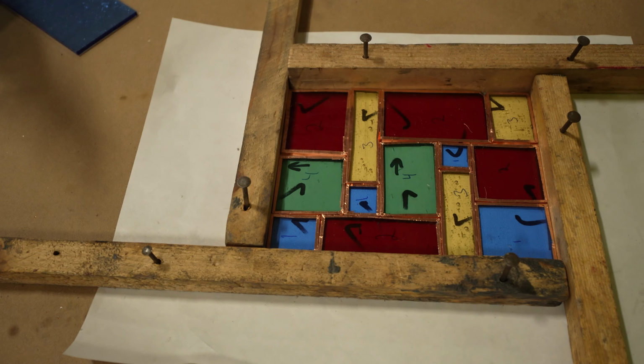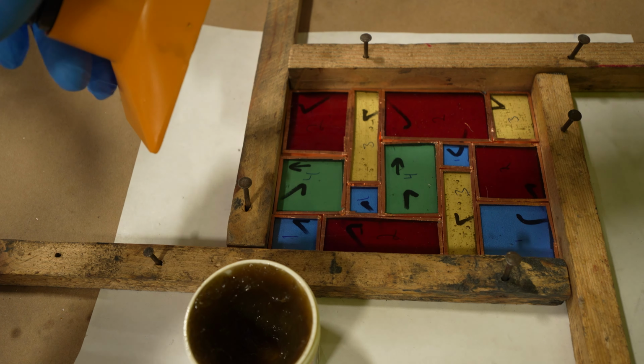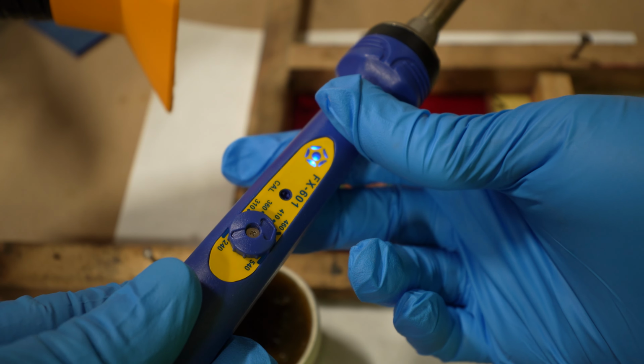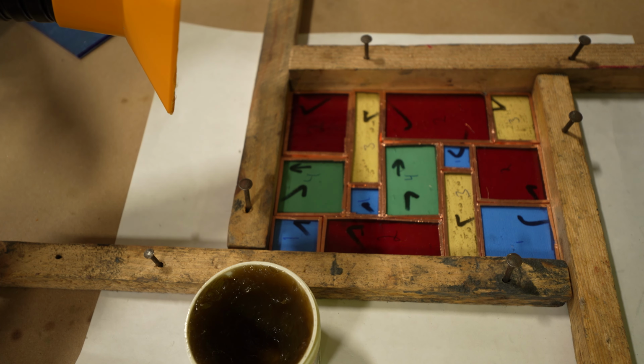We've got my mask. I'm going to be wearing some gloves. Yucky stuff, so we're going to try to avoid touching that. And we also have our fume extractors. This one has a rheostat built in, so we normally solder around 460. That means you can move pretty quick. It's a little bit warmer, maybe, than most people.